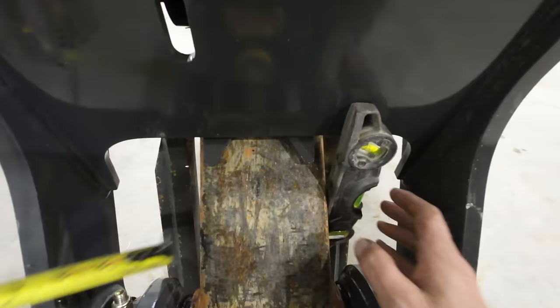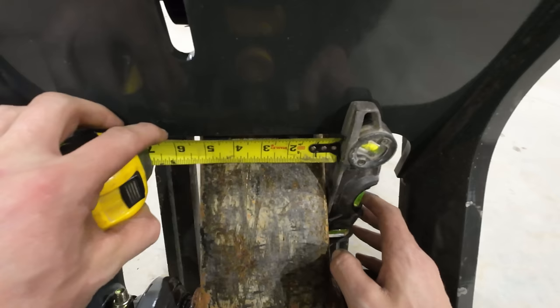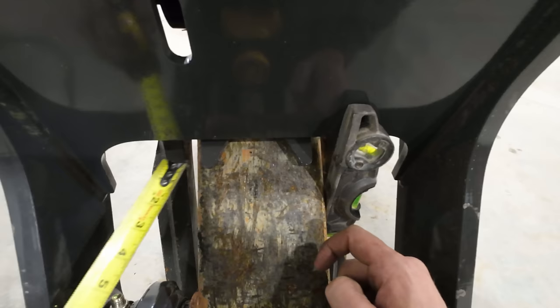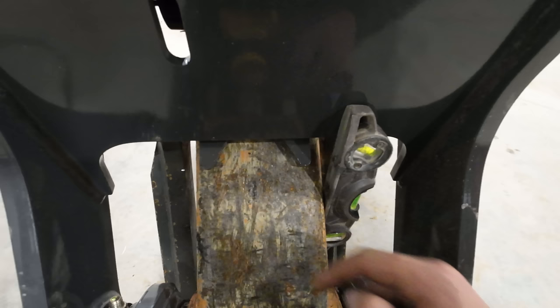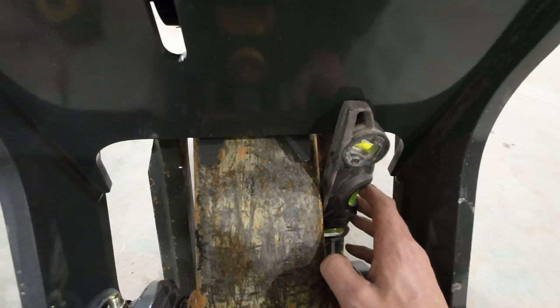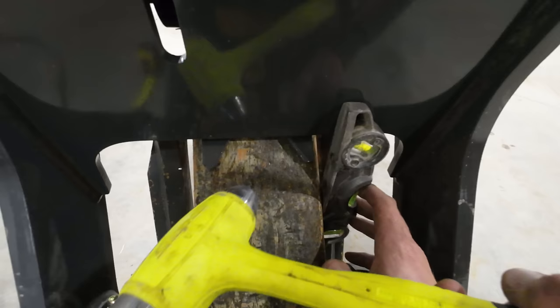So with the thumb leaned all the way back against the stick as it is, that locates the mounting bracket vertically, up and down on the stick. So I just need to center it side to side. We'll put a couple heavy tacks on it on all four corners and make sure everything's good. Looking for heavy 9/16.